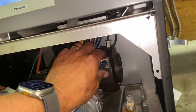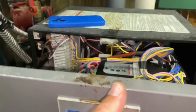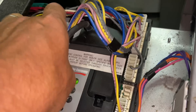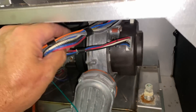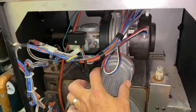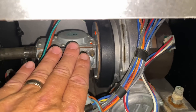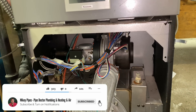The blower motor's kaput. Well, let's take a look at the Sage controller. Alright, for all of you who do not know, this right here is the blower motor, this is the gas valve, and the gas valve and the blower motor are connected to the manifold that connects to the front burner plate. Inside here we have our swirl plate and all other good stuff, but one of the first things that come on is the blower when there's a power cycle of the boiler.